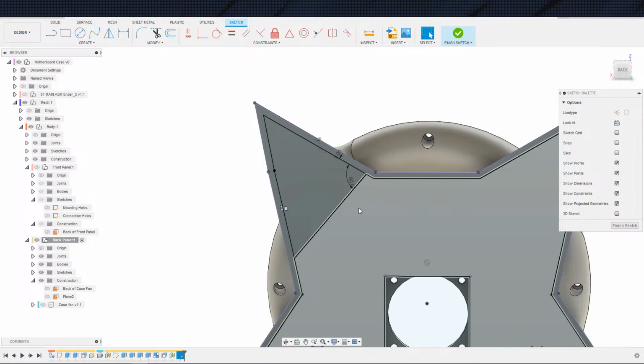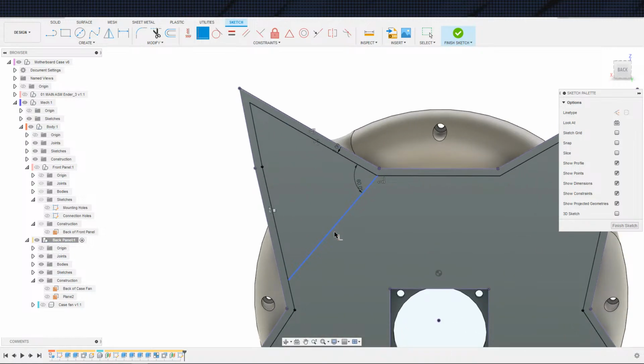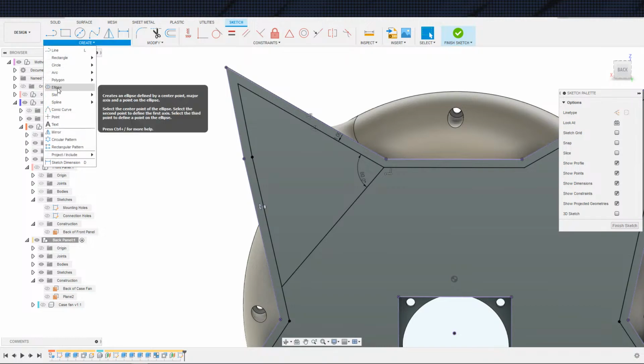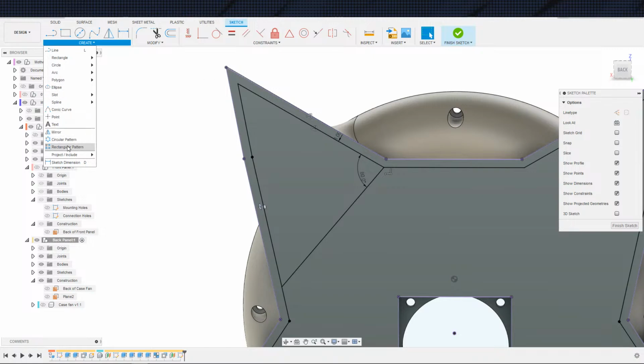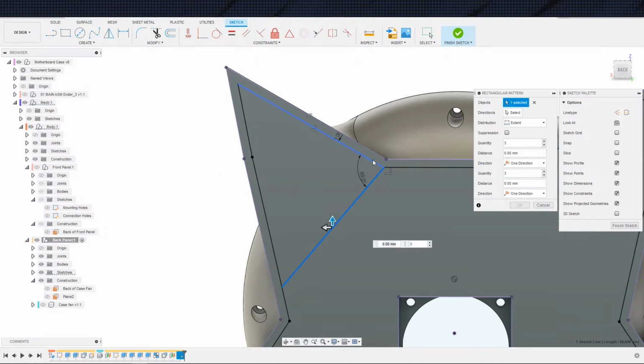I will go to delete this line, I think, because I will instead replace it with this guy. And then we will go ahead and, like I've said in the past, I don't particularly like patterning and doing all this stuff in the sketch. However, I think in this situation it just saves us the most amount of time. Pattern along path. No pattern along path in sketches, which is something I'd know if I did this more often in sketches, but I normally don't. So we will do spacing. Probably 3mm spacing is correct.